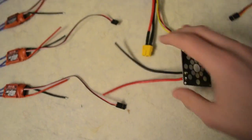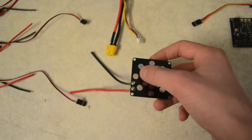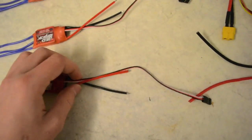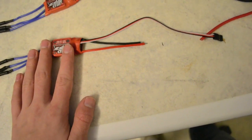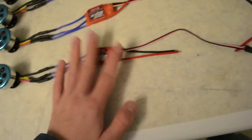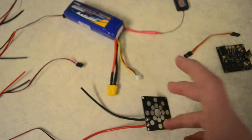And I've got an idea that I will solder on some 12 gauge wires going around here, and those will be going up to XT60 connectors. Those XT60 connectors will connect to the ESCs, and the ESCs will have an XT60 connector on them as well, so I can always change them out — upgrading them, or I can take the ESCs and the motors out and put them in an airplane if I want, without having to unsolder and solder connectors. I also get a little bit of extra length, about 7 cm or so more.